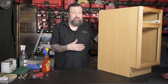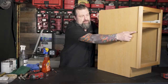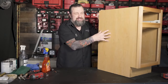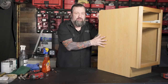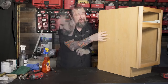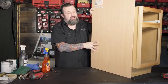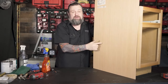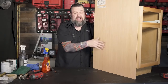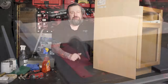Let's talk about some of the challenges we can run into. Sides of the cabinets can be one of them, especially with face frame cabinets. There's a big drop back in this panel — this is a particle board cabinet side. Nothing wrong with particle board, but this has a picture of wood basically glued onto the side from the factory. The answer is to pop down to your home improvement store, grab one of these cabinet skins from their pre-manufactured cabinets, and cut it to size. We'll have a nice piece of wood on the side — we won't see that eggshell texture of the particle board. It's going to look like a much higher end project.